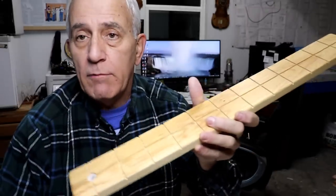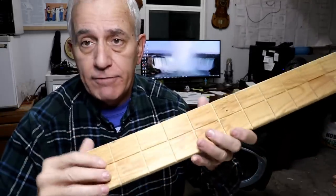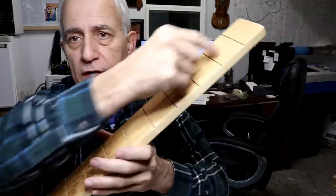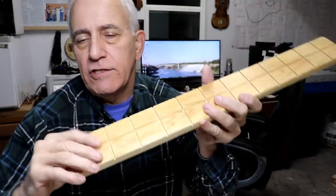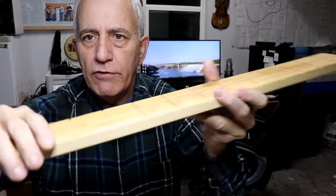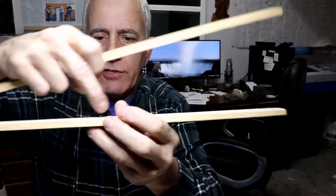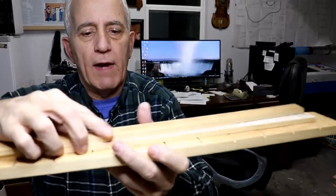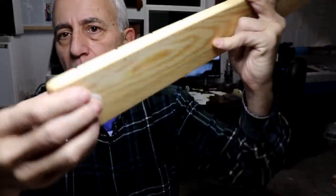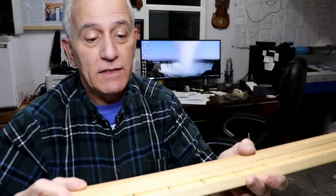I made my platen long and narrow because the first thing I was going to work on was thin strips. You can make platens square and flat out of MDF for larger pieces of veneer. I flattened this off really well and rounded all the corners off because you don't want anything that can catch on your bag. Because I was making really thin narrow pieces, I also made a couple of cauls — one for the bottom and one for the top — the same size as the strips I was gluing. The material goes in between the cauls, which then sit right on top of the platen, so even if you cover the hole, the airflow goes down through the slots and sucks the air right out.